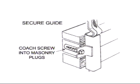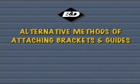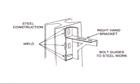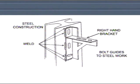For the door guides, B&D recommend that you use the 40 by 8mm coach screws supplied with a good plastic masonry plug or suitable masonry anchors. Masonry blockwork should be properly filled and reinforced if brackets are to be mounted directly to blockwork with masonry anchors. Where the blockwork is not solidly filled but structurally sound, long bolts should be passed through the blockwork using suitable steel plates under bolt heads. Special consideration should be given to brick type and construction of wall to ensure satisfactory fixing. For example, welding detail if fixing to steel.